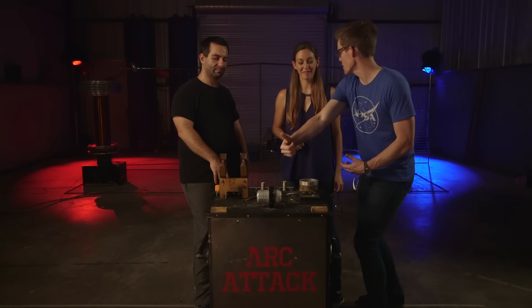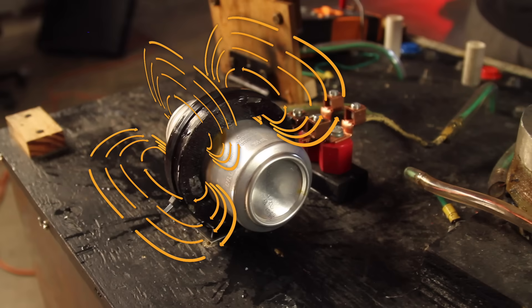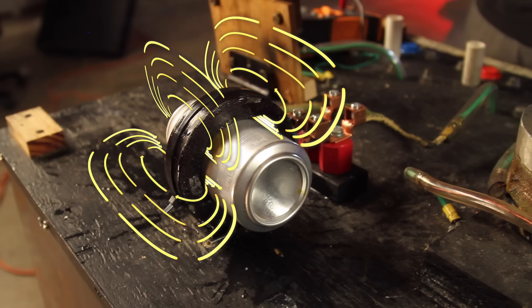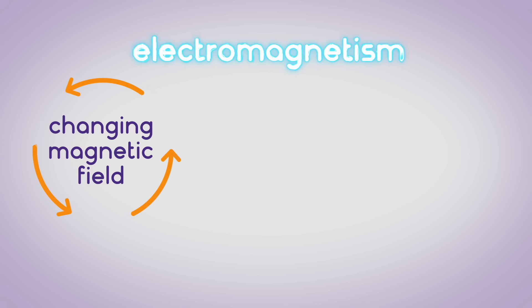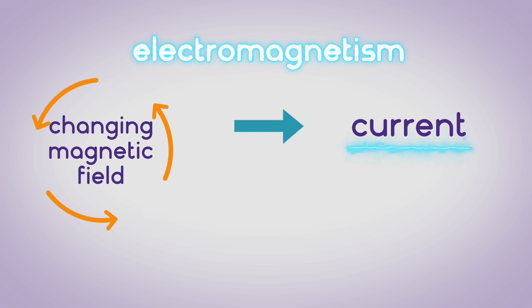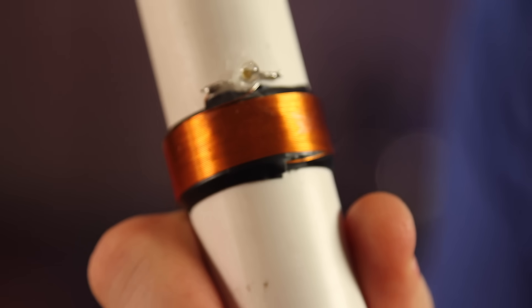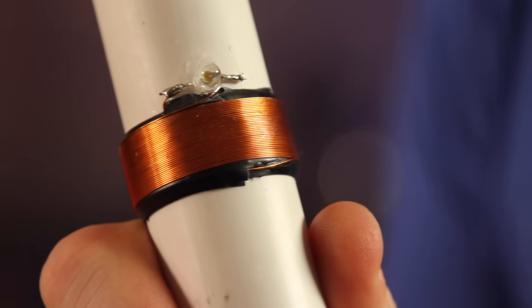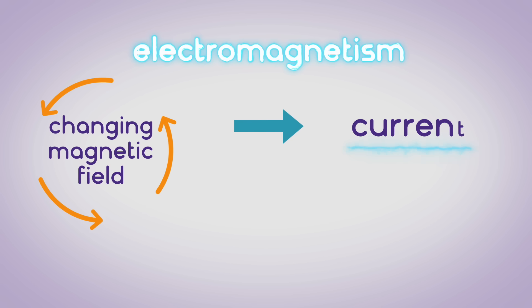It's like a toroidal shape — like a donut. That donut-shaped magnetic field is getting stronger; it's changing as the current increases. Another weird property of electromagnetism is that changing magnetic fields near a conductor can induce currents. We can see that with another cool demo Arc Attack has, where you drop a magnet through some coils of wire attached to LED lights. The LEDs light up because the magnetic field going through induces a current — no batteries required.